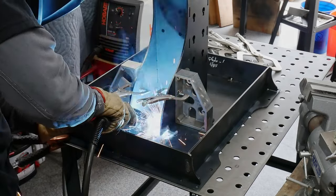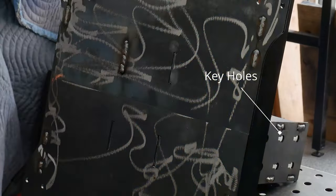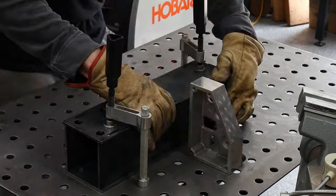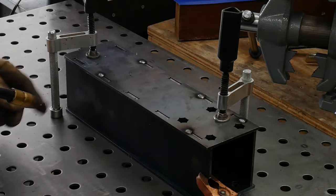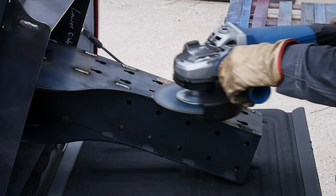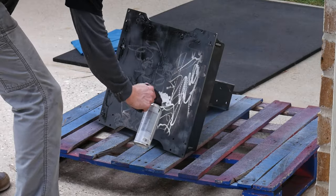There are two cool features about the stand to point out here. One is that the upright is offset so that the user doesn't bump his feet into the stand when using the disc grinder, and two is that there are keyholes along the sides designed to accept carriage bolts. While I didn't mess with them during this build, they could be used for various attachments, and I thought this was a nice touch from Richard. The next section is the internal pillar. This pillar slides inside the upright to give the user adjustable heights and also capture those carriage bolts. I didn't do it on my build, but this would have been an ideal time to weld in the eight nuts that will be utilized to attach this pillar to the upright. Just make sure they are flush with the outside so as not to impede the travel of the pillar.